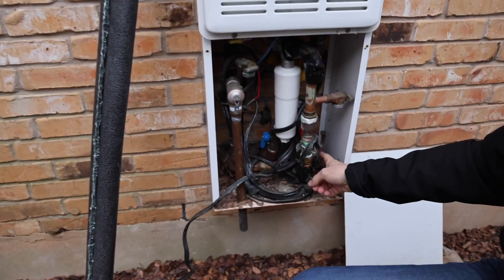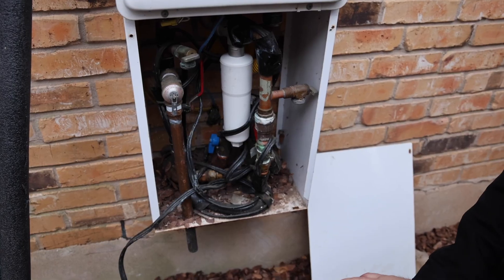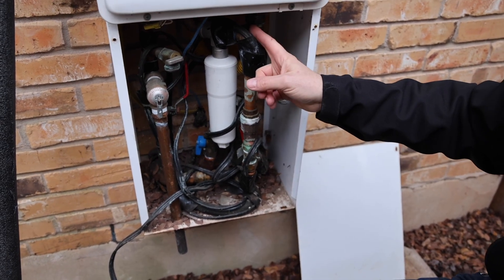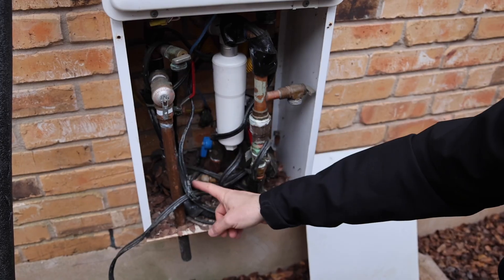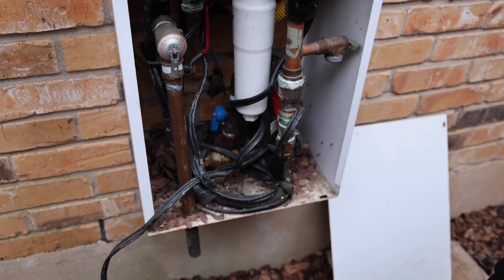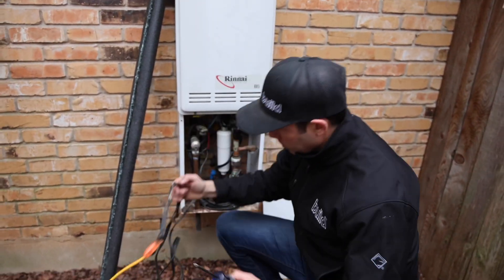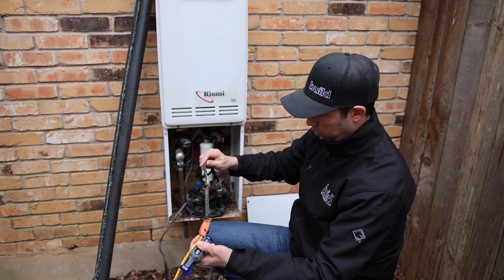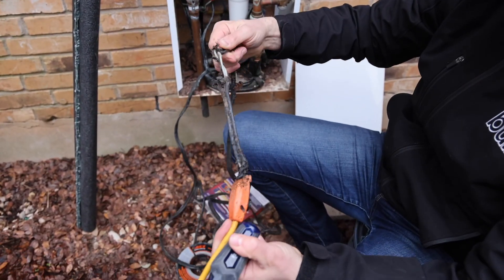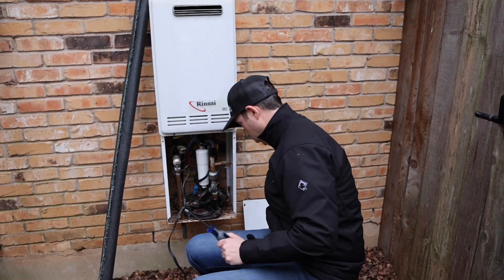What's happening here is these pipes right here — this PEX line from the house that's going through the brick, this is a remodel situation — that line there is supplying the cold water to the unit, and the hot water out of the unit is going back into the house. I actually put heat tape on this some time ago, but it's looking like it's gotten some rat damage or something; this is looking bad. I don't believe this is going to work, so we're actually going to cut this off and pretend like this had nothing.